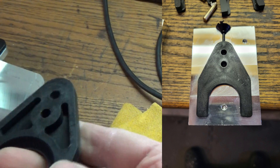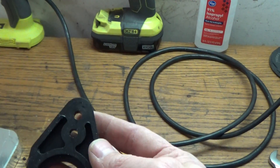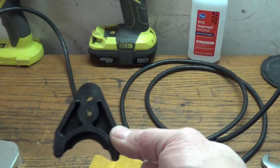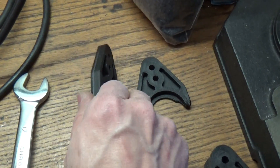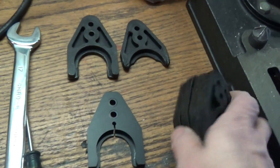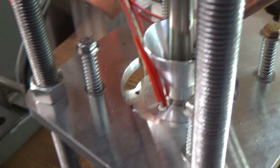Here is a good one — you can see the parting line is perfect. Pretty stoked it made really good parts. I did have one where I didn't have enough pellet material and so it only injected a partial. I had two issues: one with the splitting and the second with a partial fill. Since then I've done five good ones.